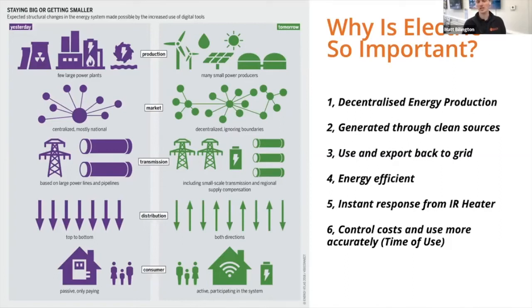So really they'll only take energy from the grid in off-peak periods, or when we've seen a surplus in wind and renewables, when we can charge those overnight. And that's where the tariffs are kind of moving to. We'll see a time of use tariff coming in where our heating system will respond to that cheaper drop down in electric prices, maybe from 15, 14 pence per kilowatt down to 5 pence per kilowatt. And some of the big companies out there are already starting to do that.